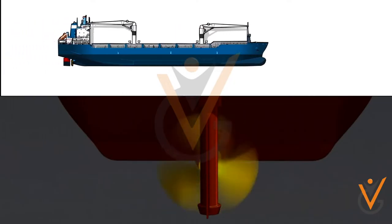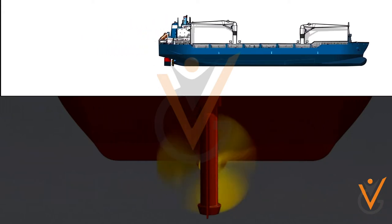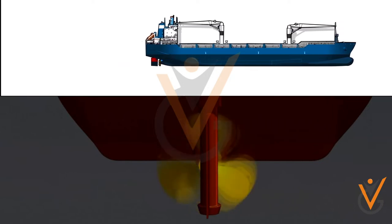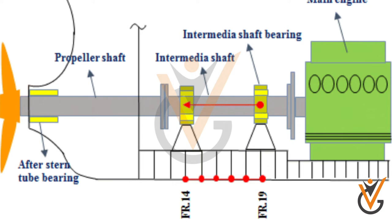The ship is displaced in the water, and the propeller is used to drive the ship ahead or backwards. Depending upon the direction of rotation or pitch of the propeller, the engine of the ship is connected to the propeller of the vessel via a shaft arrangement.